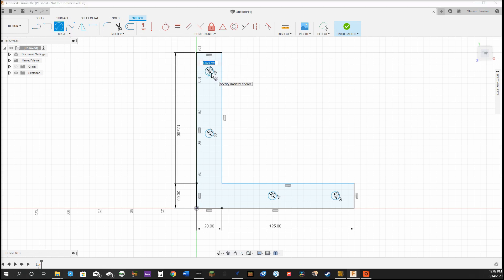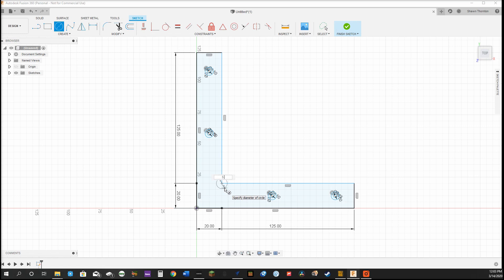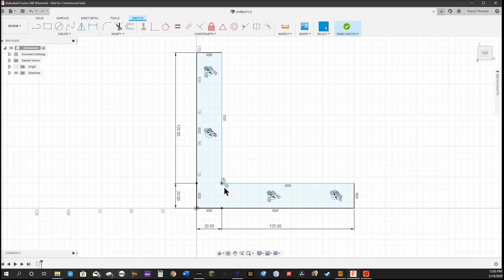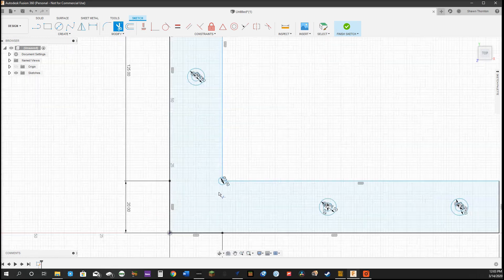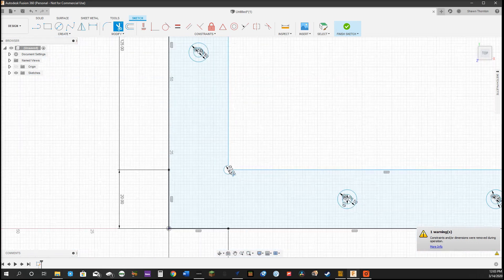So now we're going to go back and put in the inside dimensions — 3.25 millimeter. I'm sure there's a faster way to do this but again I'm not a Fusion 360 expert. Okay so now we've got all that done — now we need to do our center piece. Where our corner is not hitting, we just do a 3 millimeter circle there. Then we'll zoom in and use our scissors to trim out the extra pieces so that it actually cuts into it.